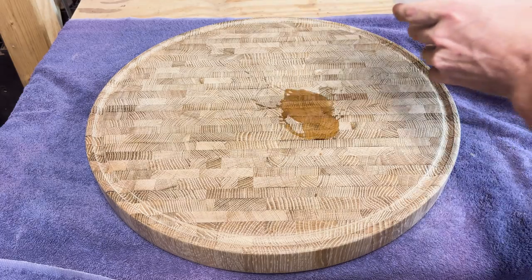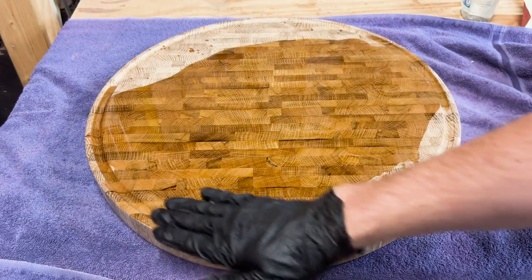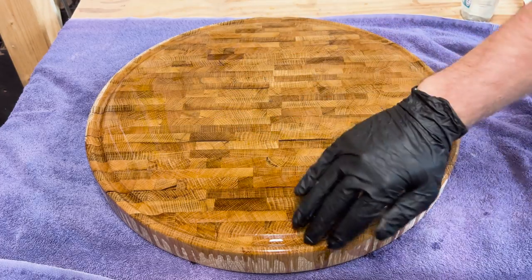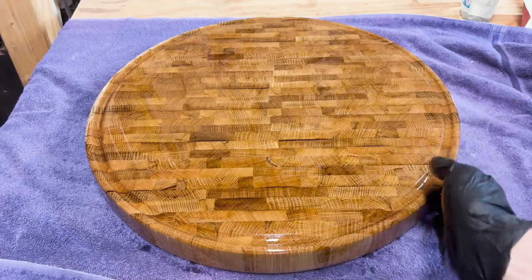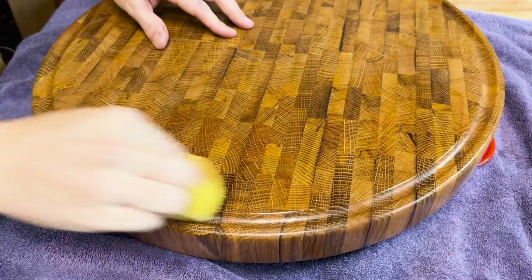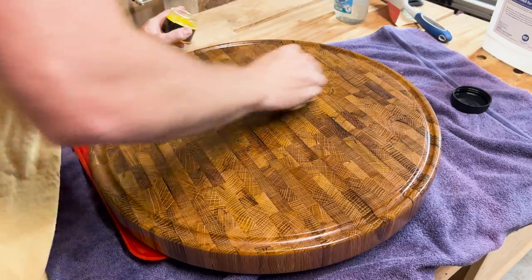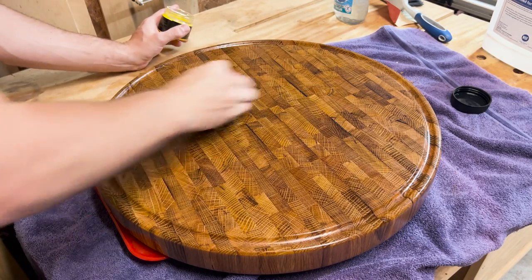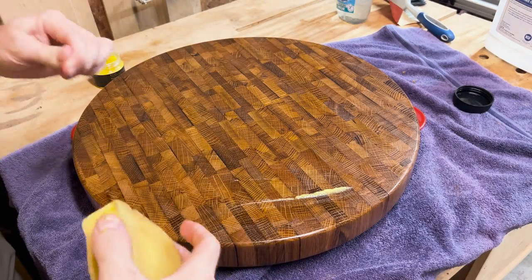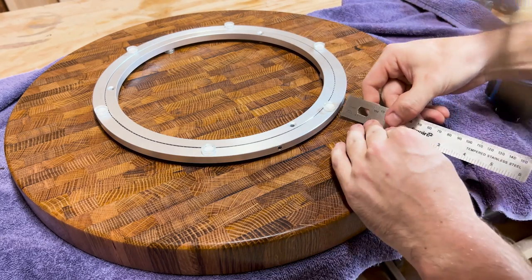It was now time for the magical moment — adding the mineral oil. I got a nice beauty shot of me adding it, but in reality I just ended up dunking it into a bath and letting it sit overnight, just because of how massive this thing is and how much would eventually soak into the board. After leaving it for a day, I came back and did my final step in the finishing process, which was to add a thick application of beeswax. Mineral oil seeps into the wood to offer protection against changes in humidity, making the wood less susceptible to cracking or warping. It also enhances the aesthetics by adding volume to the grain and enhancing the natural color. The wax acts as a physical barrier on the surface that protects against stains and liquids, and also aids in sanitation by filling and sealing knife scars and microscopic cracks where bacteria would otherwise gather and grow.